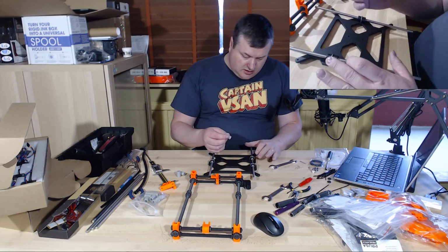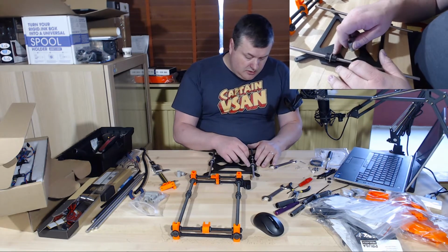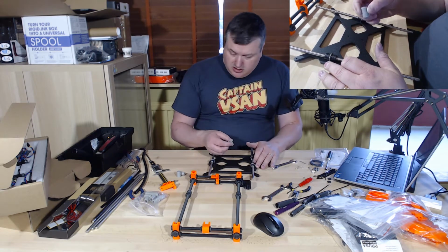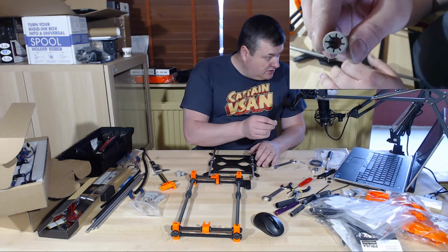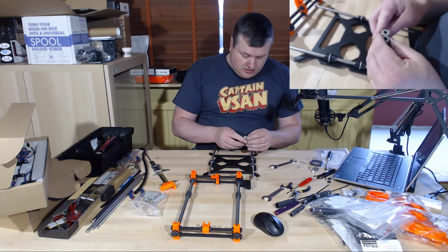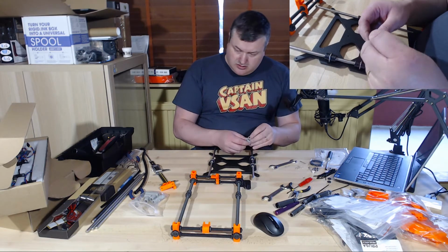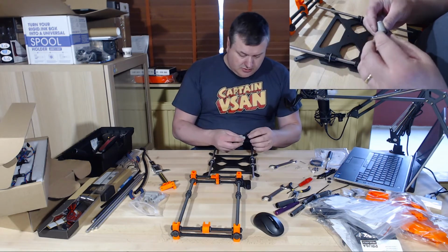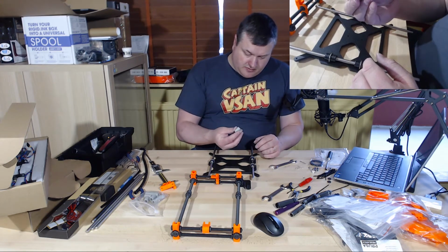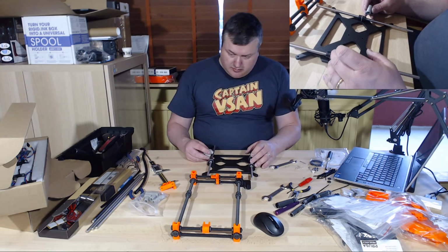And again, if you have the MK2S with the metal fasteners here, those plastic bearings are not gonna cut it. They're just too weak, and they compress too much to be used here. I think it will be okay in the X carriage, because there are just two zip ties on each, so there's not so much compression in the middle. But I will definitely inform you if I'm not happy with those bearings there either, and then I will just get those bearings at a later time and put them there.